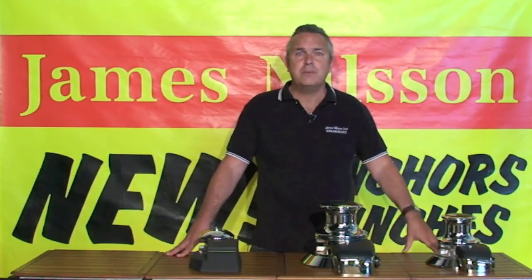With the use of the ratchet and clutches, the rope capstan can be run independent of the gypsy, for use as a second anchor capstan or warping drum. Removing the chain pipe cover and fitting the emergency wind handle supplied also enables emergency wind recovery.